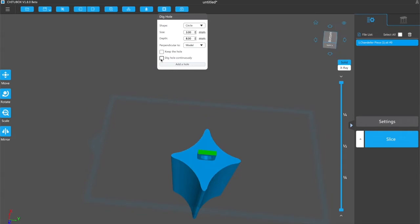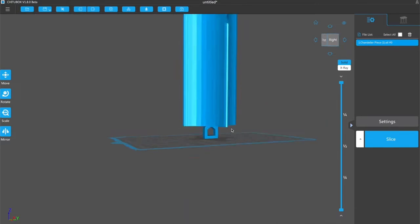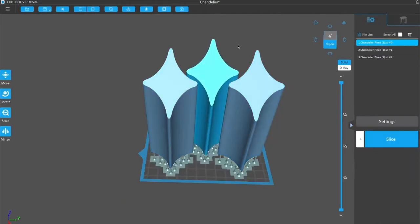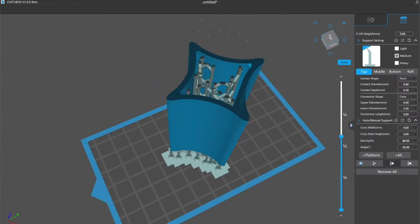I'll put four little holes around each of the outsides of the points. The top section isn't visible on the end part, so I don't need to fill them back in or anything. Now I'm going to go ahead and generate some supports. I know you should typically print things on angles for resin printers, but in this case I'm going to try printing it upright because if it works I could fit three on a bed and it would be a little bit more efficient. The support settings weren't working very well so I've had to remove them manually.